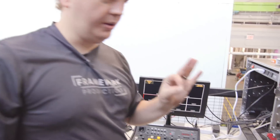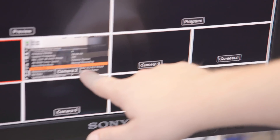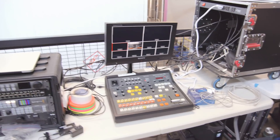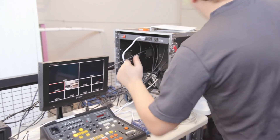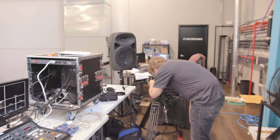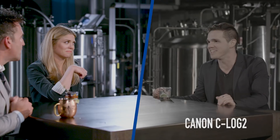It does show up. Great. Once you get that in and you see it, everything kind of relaxes a little bit. Now we have 4K in camera and 1080 in the switch at 2398. I'm going to change the resolution from 1920 YCC 4:2:2 10-bit to 4K — specifically 3840 by 2160. Let's power cycle it and make sure there are no surprises. Boom — that's a good sign. So now we have 4K in camera, 1080 in the switch at 2398. Now the next step: I want the cameras recording in camera.